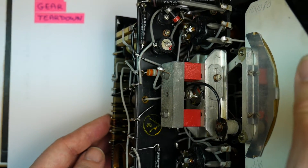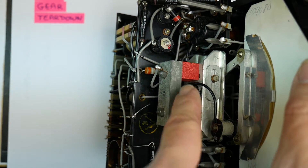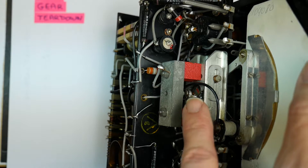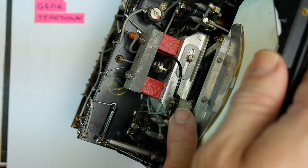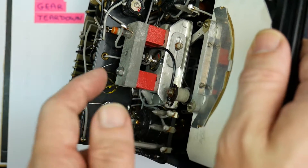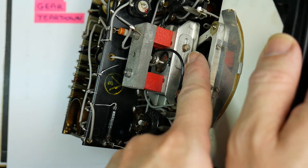Let's lift that up a bit — I can see more of the magnet and the pointer itself. In here these magnets are painted red, which are permanent magnets; painting them red is one of the things done in the Mark II — the Mark I hasn't got that. One terminal here, another terminal here coming out of the meter movement. That's the swamp resistor, simply in series with the coil of the moving coil meter — a wire-wound resistor, a little bobbin of wire with a certain resistance. This thing that mechanically slides along is to adjust the intensity of the magnetic field. These magnets are not particularly calibrated, so you slide this during calibration to set the exact amount of magnetism needed for the meter to read correctly.